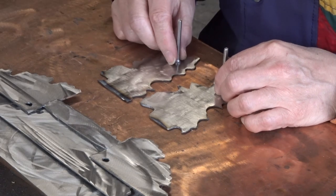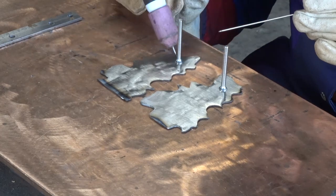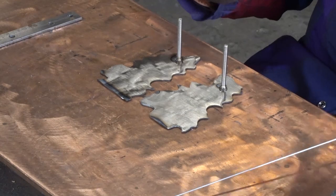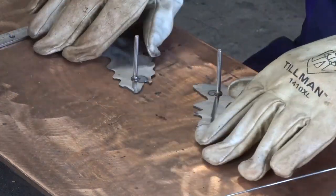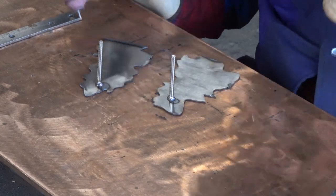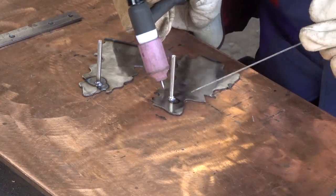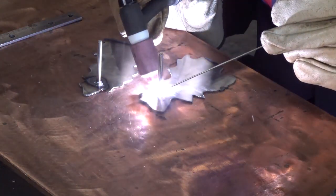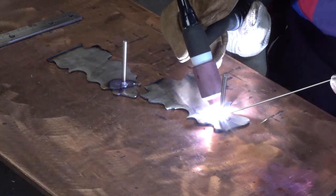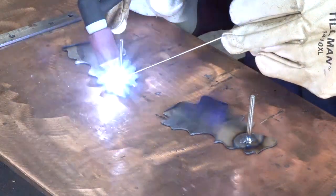Here I am preparing the stanchions on which the other pieces have been mounted. I like to weld the screw heads of the mounting screws to the back side of the facade. Therefore, you will not see the screws when you're looking at the front of the sculpture. I wish to keep all means of attachment and operation invisible from the patron who's enjoying this sculpture.